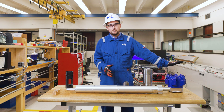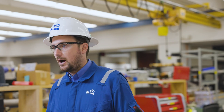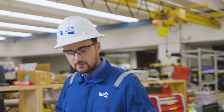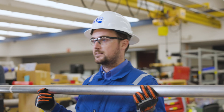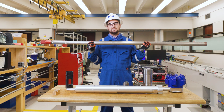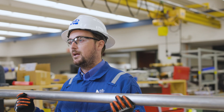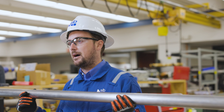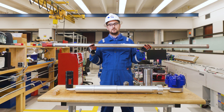Now we've deployed the tool string and disconnected the wireline. You might wonder — the tools are still down there, how are they still powered? The answer is we have batteries. Not like batteries you see in your house — we have smart batteries. The smart battery monitors the tool string and works at both 150°C in standard temperature and 175°C in high-temp scenarios. These smart batteries monitor the tool string and can cycle power autonomously while we're in memory logging mode. This brings a great advantage to the ThruBit logging string.